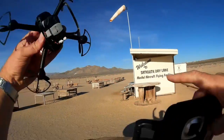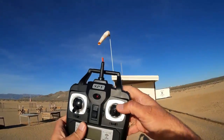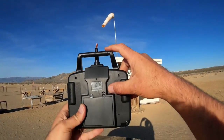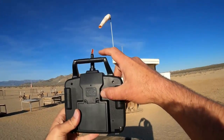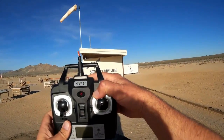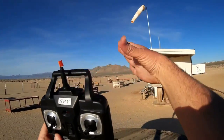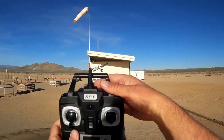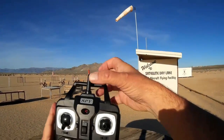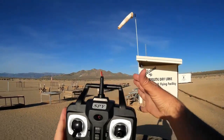I just need to get much better range than 70 meters to be satisfied with this quadcopter for the use I want it — aerial video with this 808 keychain camera. So what I did was I removed the stock antenna that came with this and replaced it with a single copper wire. The wire is 93 millimeters in length from the point where I soldered it onto the circuit board, which makes it a three-quarter wavelength antenna at 2.4 gigahertz. I'm hoping that will increase the range. With a three-quarter wavelength antenna, it's going to be somewhat directional — I'll need to point the sides of the antenna at the quadcopter to maintain contact, especially at distance. Less energy comes out the tip, and that energy instead goes out the sides, giving increased range.